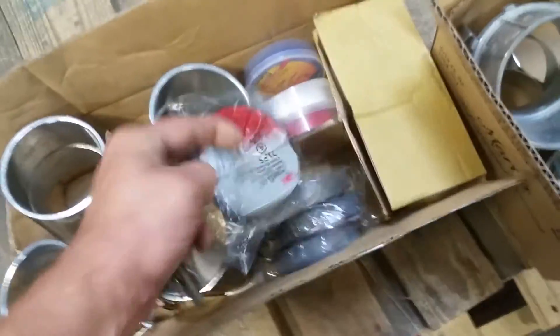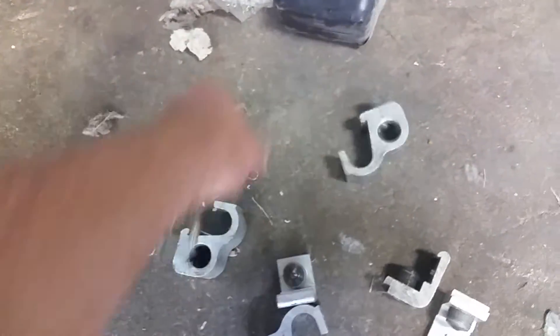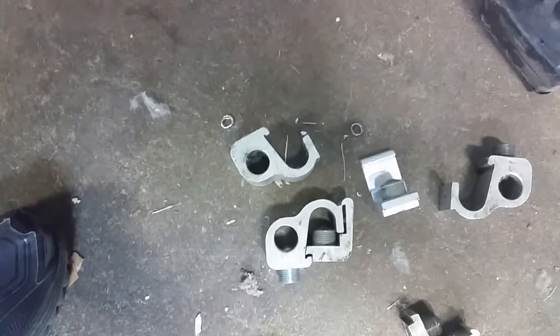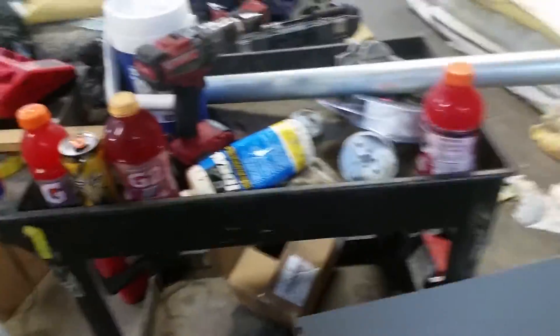We've got this tape — it's 3M, it's actually rubber tape. We're gonna put that around the splices to splice it back together. Wire in, wire in, splice it together — rubber tape, a whole roll on each one, and then we're gonna come out with some black tape to phase it correctly. And these are split bolts.